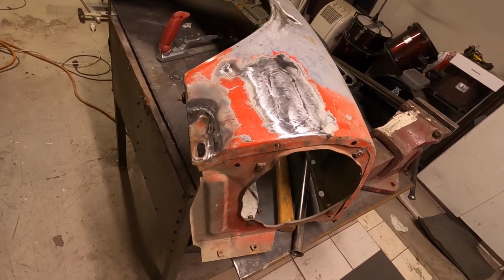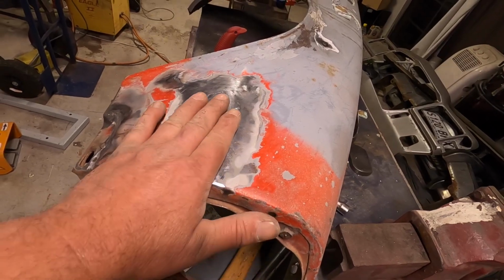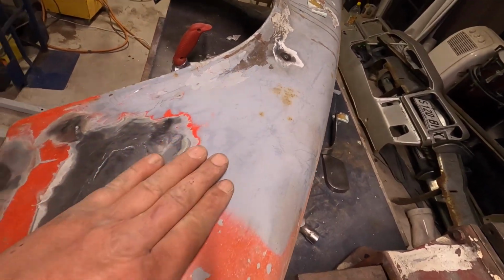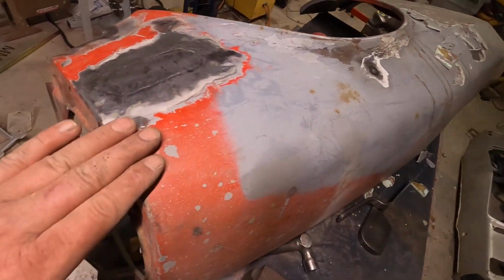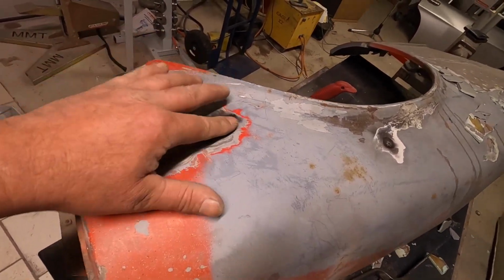So that's going to be about it for the night, I reckon. It's pretty much the same, the right shape. I'm going to planish it a little bit more yet, but what I've got to do is take the rest of the paint off the guard, because it's hollow there and it's hollow there, which will relieve the bit of the high spot that's there.